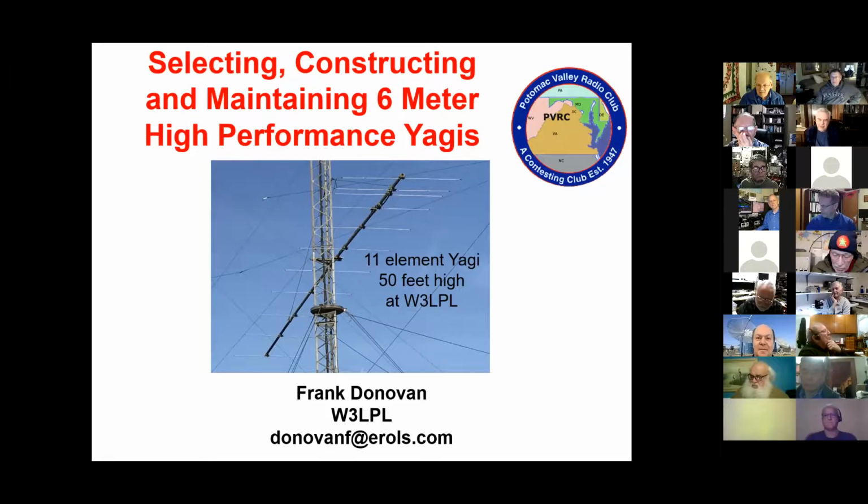Let me mention one other thing. I need to put this in a future presentation as well. You will occasionally see this when people have side-mounted Yagi antennas on a tower. You never want to place the parasitic elements very close to the tower face, because the tower face will detune the elements in exactly the same way that placing a parasitic element very close to the boom of a Yagi will detune it as well. The exact same thing happens when a parasitic element is very close to the tower face.